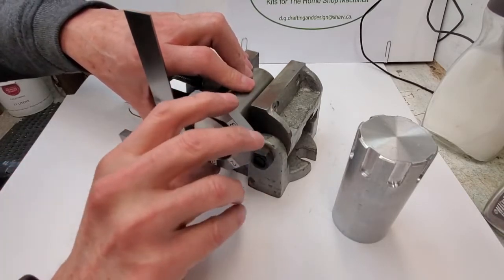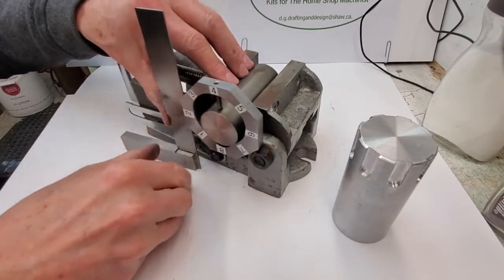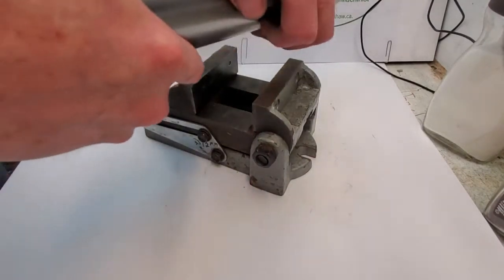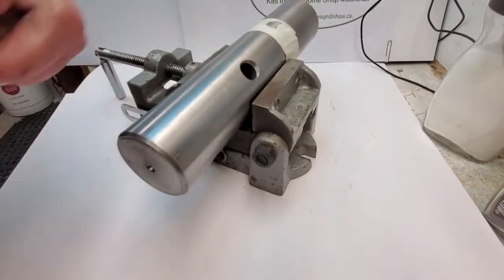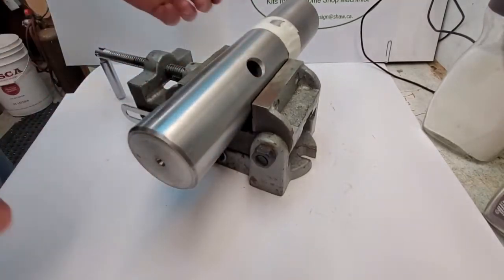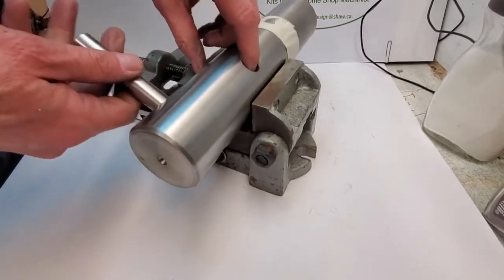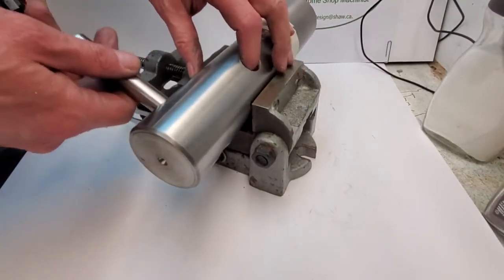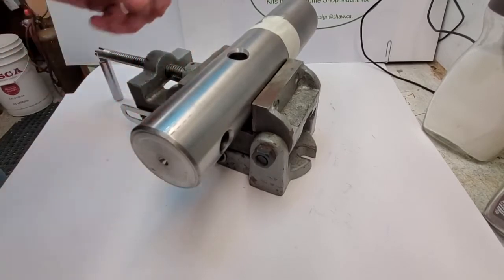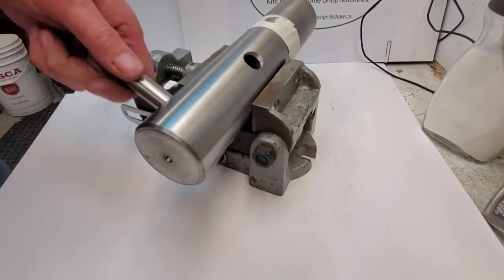It's hard to get your head around until you see it. Once you see it, you realize. Here's a little bit bigger shaft. This is a tail shaft from an auger. This is a standardized product that many manufacturers create. It calls for 2 holes, 180 degrees apart, 1.5 inch in, 3-inch spacing, 2 21/32 holes, 90 degrees apart, or 180, pardon me.